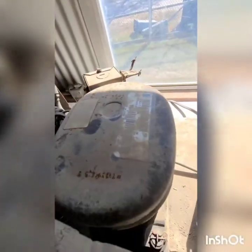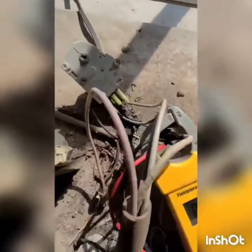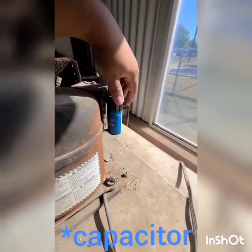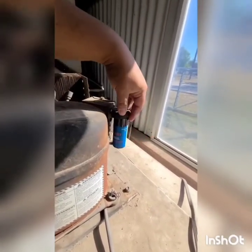I'm going to plug this in here and then take it out of defrost and see if it starts up. I have my meter on amps on the power wire which goes to the timer, and the compressor set in the old place. It's a little shoddy but it's not going to move — the box has a cap that goes over it. I also put the old cap from the capacitor on here so it can kind of block itself. I'll probably put a zip tie just to hold it in place. Here's the bad one and the unused components.